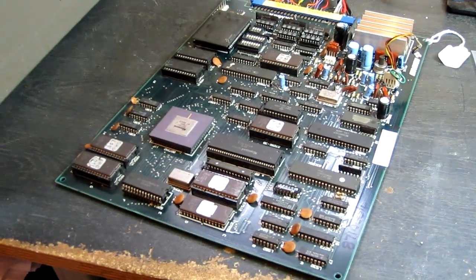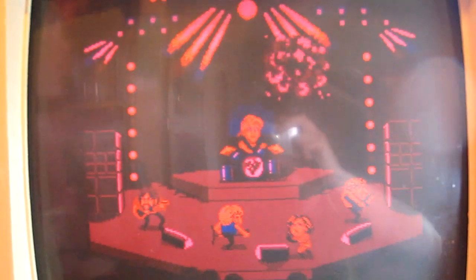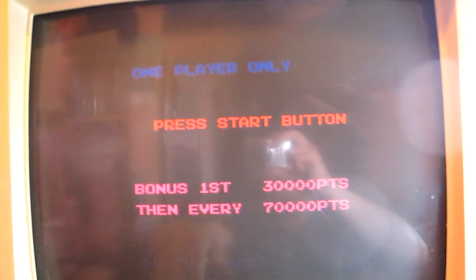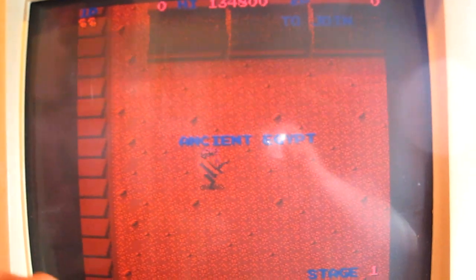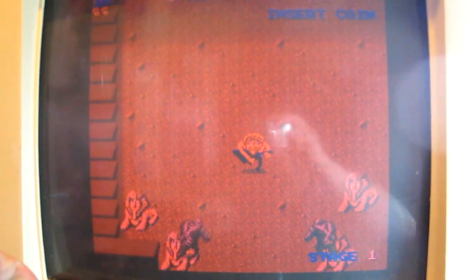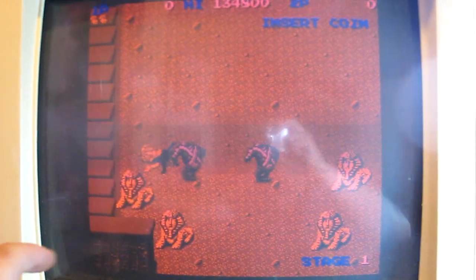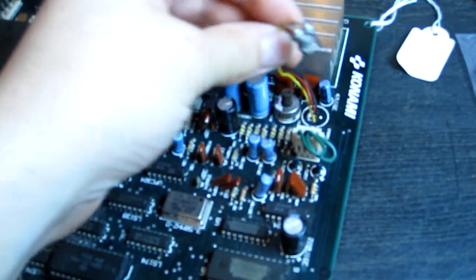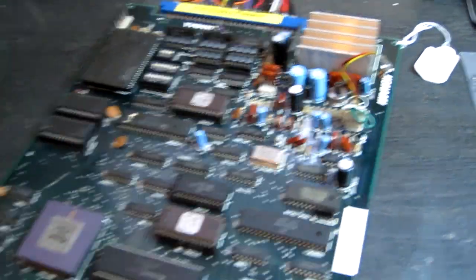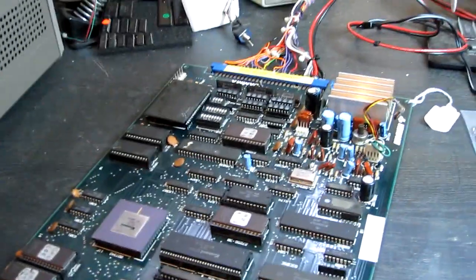Next up on the bench is a Konami Rock and Rage PCB. It currently appears to be missing green colour, but other than that it seems to power up. I want to start a two-player game, but it looks like one of the optos on the inputs are not working. It's actually playing and sounds are working. There's a dodgy fly-lead volume control there that needs replacing. So I'm going to look at the optos and the Konami custom to see if I can fix the colour and control problems.